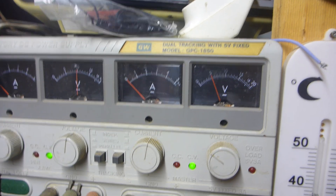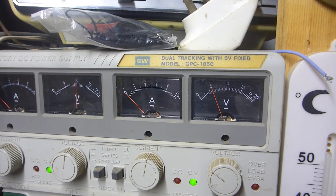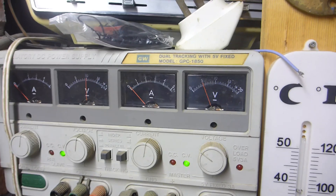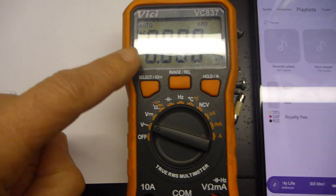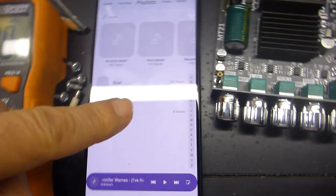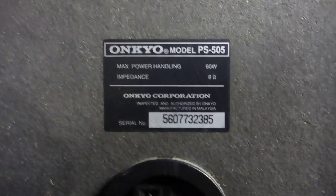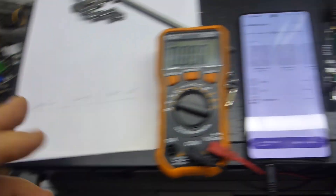Let's see what happens when we limit voltage to 5 volts — that's only about half an amp, sounds pretty hashy and distorted with all volumes cranked up. My test rig has an AC voltmeter hooked up to the output of one of the speaker channels, my phone as a source, and I'm measuring input voltage and output voltage. The Onkyo speakers are 8 ohms — I've measured them and the back confirms it; they actually measure at 7.9 ohms, which is pretty spot on. So we'll do some tests and see what voltage you practically need to run this little amplifier.